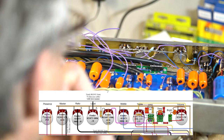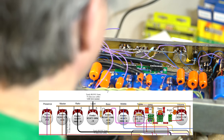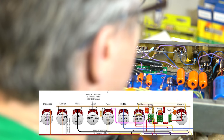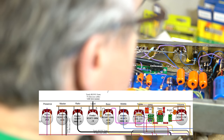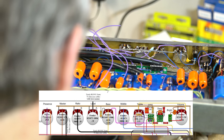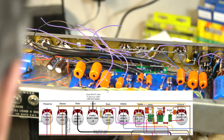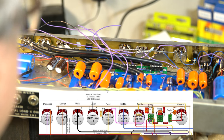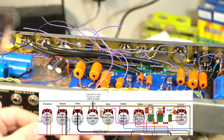The bass pot — I ran a lead to the middle of the bass pot which comes off this board connection, but the input comes off the jazz switch on the bottom. I've already had a bit of a battle getting that little lead to it. I need to jumper both of them and connect off to the bass pot. Let me see if I've got a short clipped lead that's long enough — I'll just check the distance.